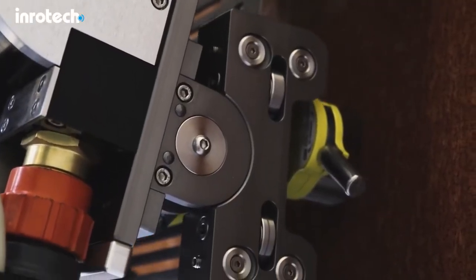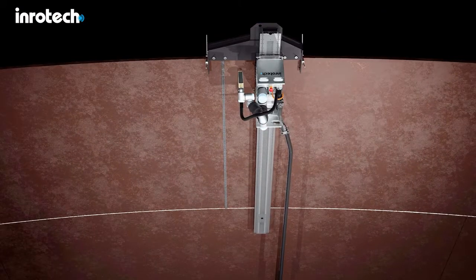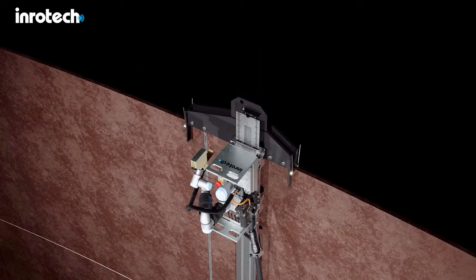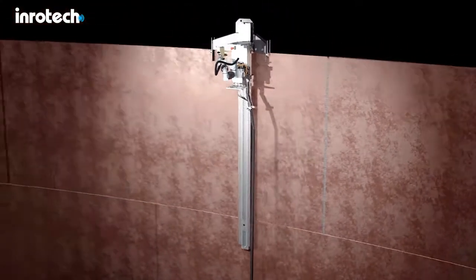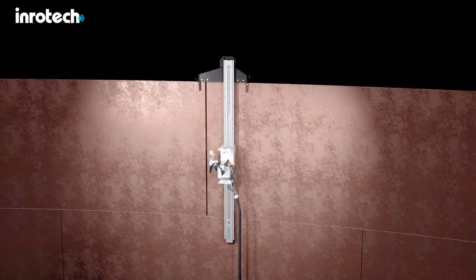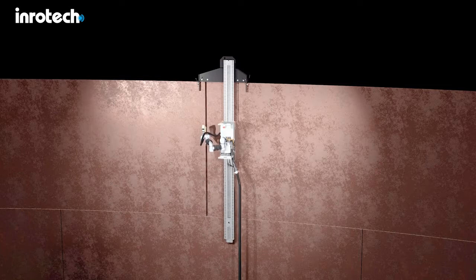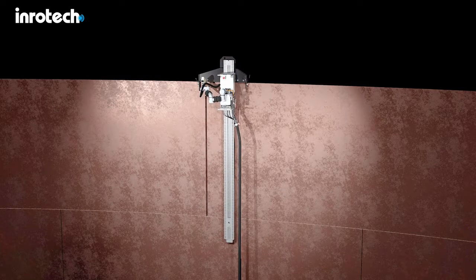The carriage runs on a rail which is resting on the upper edge of the tank in building. It is provided with wheels, so it can easily slide from one position to the next. Once in position, it is fixed by activating the lock at the top and the magnet at the bottom of the rail. The length of the rail can be delivered to any desired length.